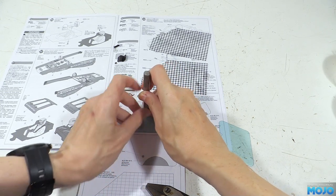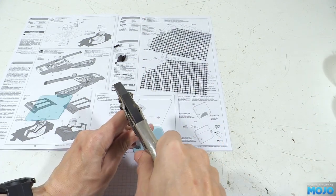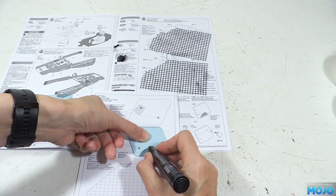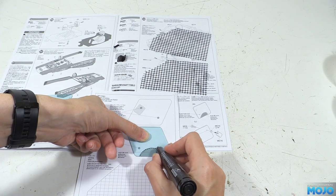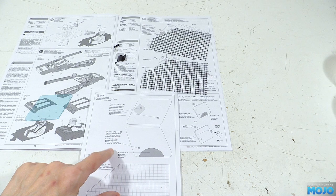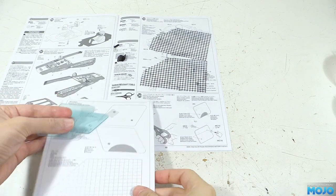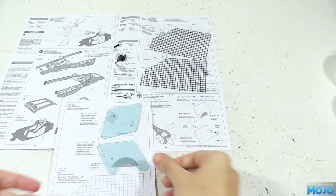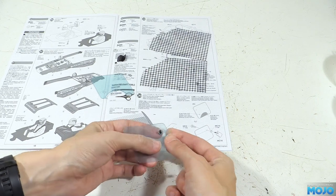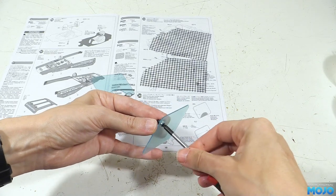Don't use pliers as a hammer. The second board only has the one hole, but it has a large cutout to clear the motor. The board has a protective peel-off layer, so we can use a marker to transfer the arc to the plastic. We'll initially cut just inside of the mark, then adjust to make it fit. The holes need drilling with a 3mm bit — or 3.1 or 3.2mm to give a little more wiggle room. That just leaves the mounting plate, fitted with a low profile screw through the top hole, then we add the spacer and thread on the mount.